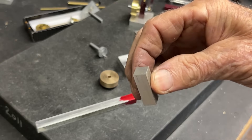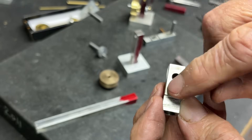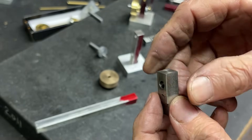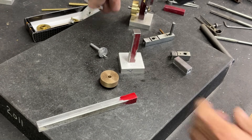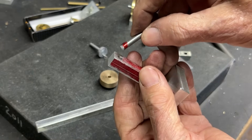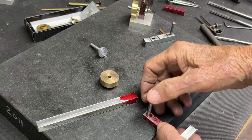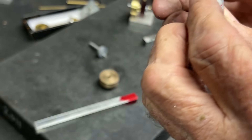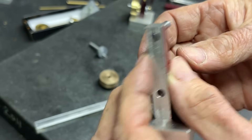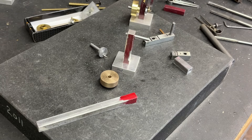The cylinder looks great. There are a few more operations I'll do in part four — two holes and a little bit to mill off — and the cylinder will be done. One last thing I want to do today is Loctite this pivot rod in place using red Loctite. I want to get it flush — and that will set overnight and be ready to use. And that's just enough excitement for today.